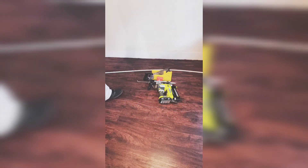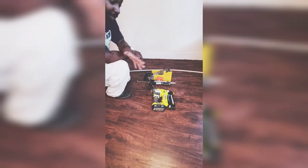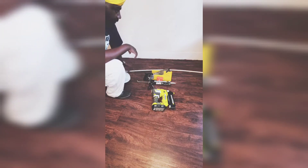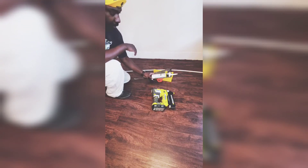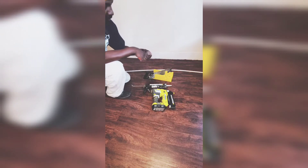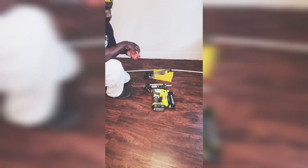The tools I'm going to be using is a small nail gun. If you don't have a nail gun, you can use a hammer and a nail. The size nails I'm going to be using are about an inch and a half. This nail gun can use up to two-inch nails or very small little nails to put in your shoe mold. Of course, once you nail everything, you want to caulk it to fill in any gaps that you may have. You also need your tape measure to measure what you need to cut and how long your shoe mold needs to be.